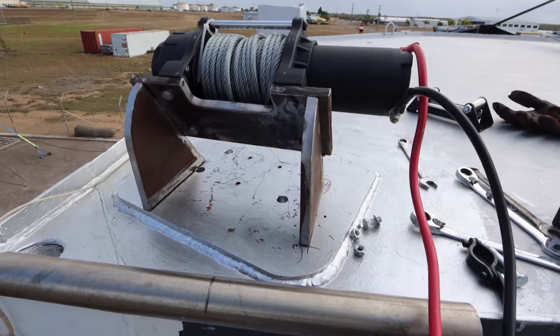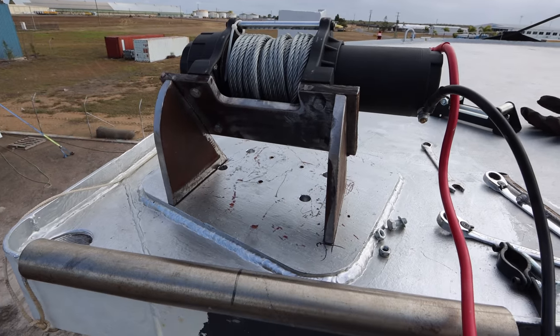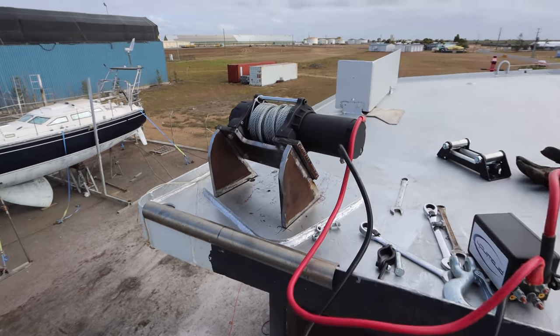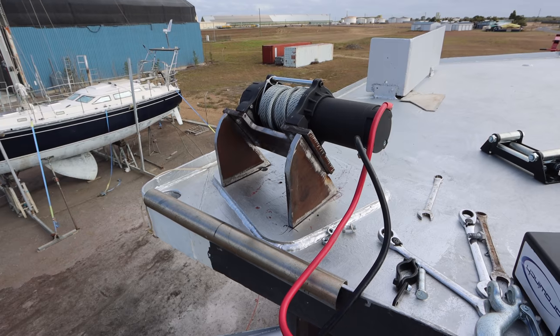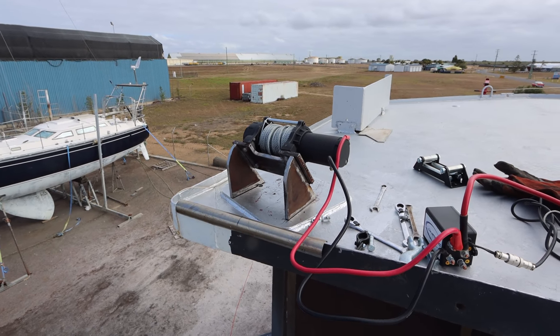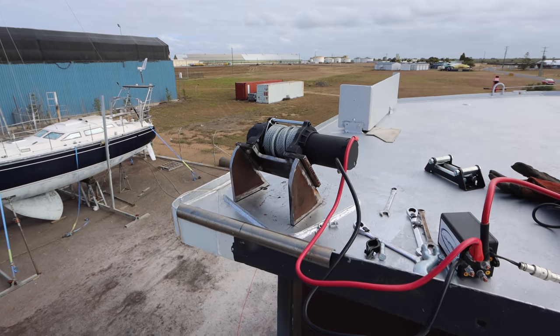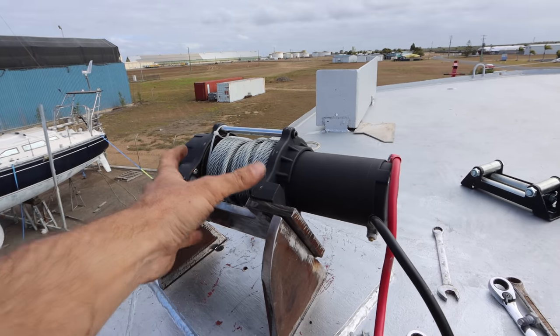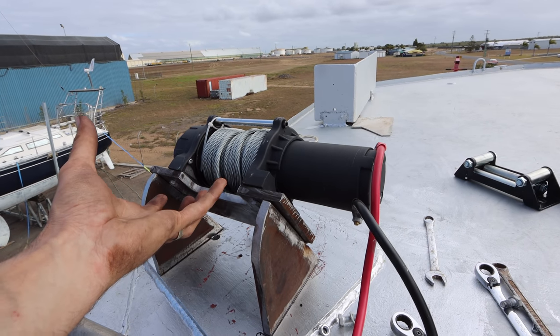There we have it. One Booty Brupeg sized bracket. So that's a 12 mil steel bracket on a 12 mil doubler. So that's going to be more than strong enough for what we need. And what I've done is I've actually reversed the winch so that when I press up to lift the wings up, it's rolling it up from the top of the drum up here, so that it gives me more clearance without having to lift the winch up higher.